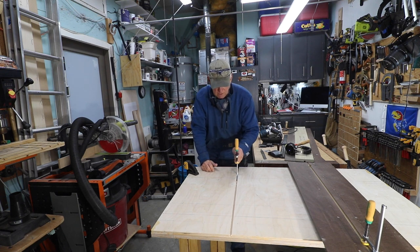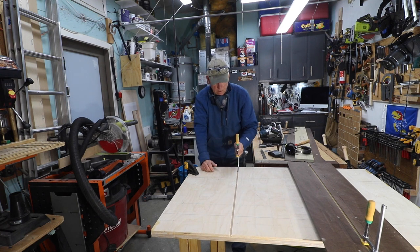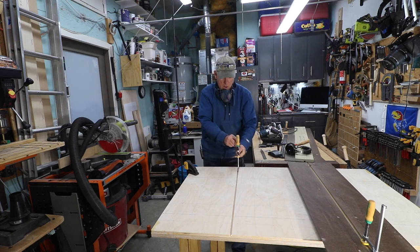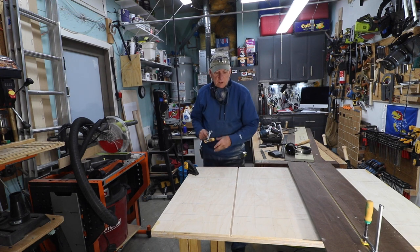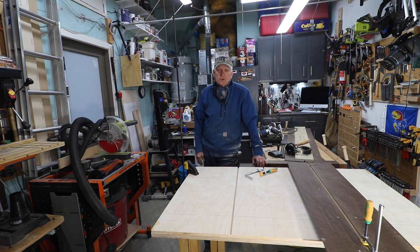So I've got a really nice clean groove here. And things are holding and gonna work very well. Just a secret, when you have these Matchfit dovetail grooves and you wanna push forward, lean this rod back so that the tip comes up. All right, so we got a beautiful groove there. That is how you put Matchfit dovetail grooves into workpieces and jigs to make your workshop super effective.